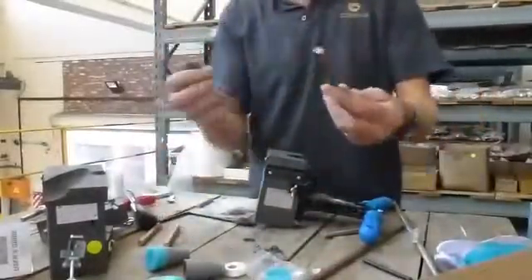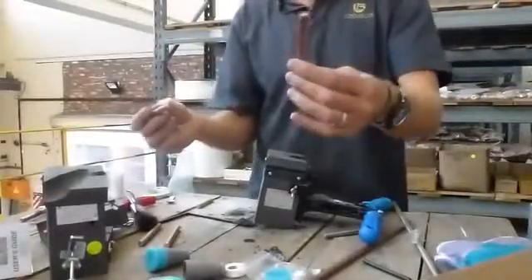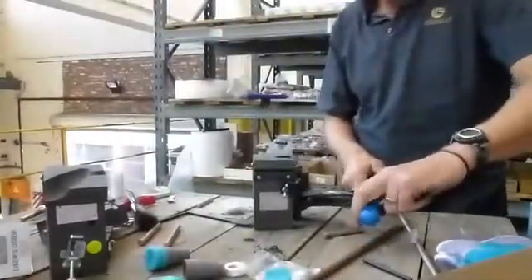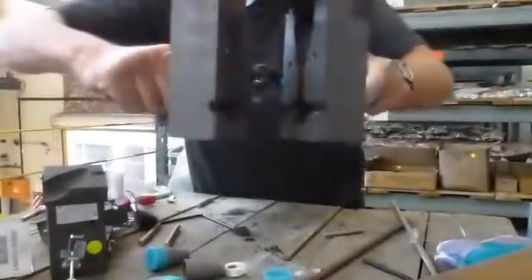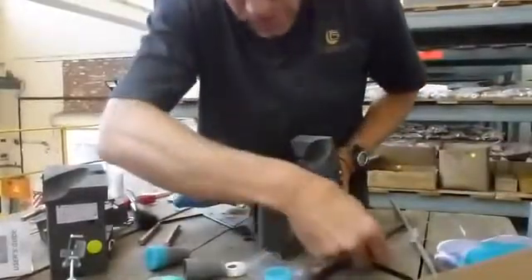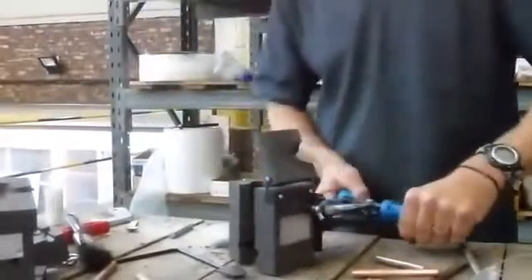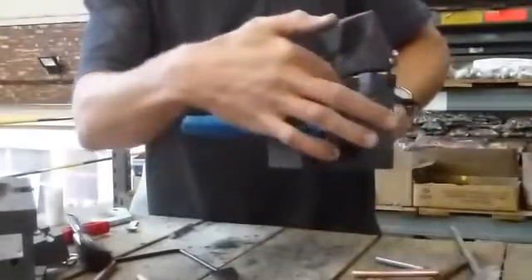Just for fun, we're going to do a twisted wire earth wire to the 10mm round to show you how versatile this is. If you look inside, you can see the weld metal chamber. In the case of the 10 to 10 join, you can see the weld metal chamber and the join chamber — that's where your weld metal powder goes.